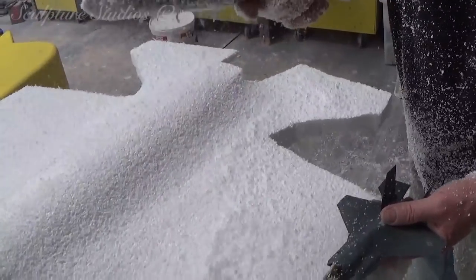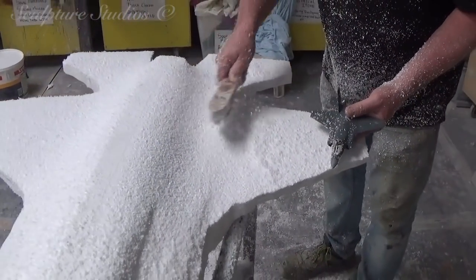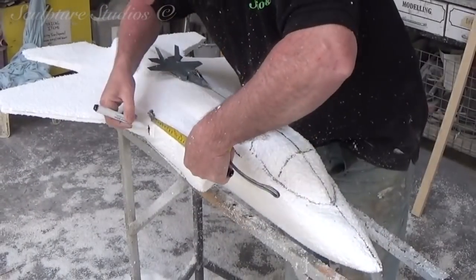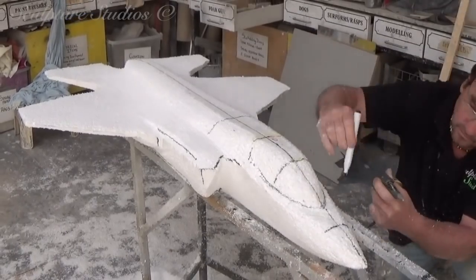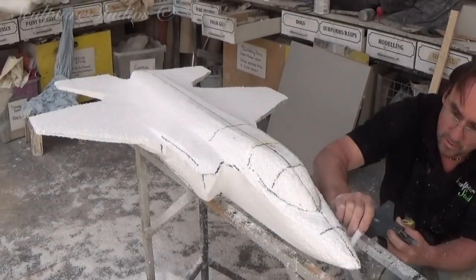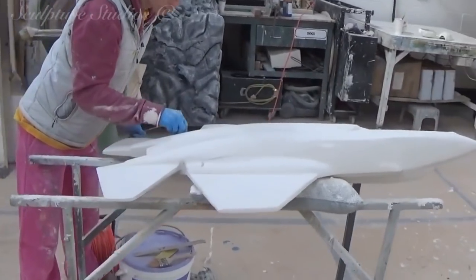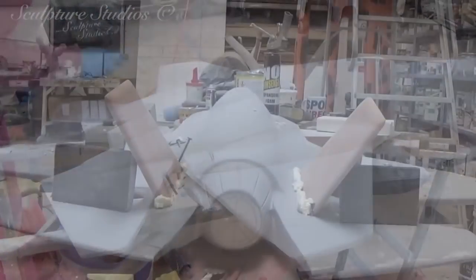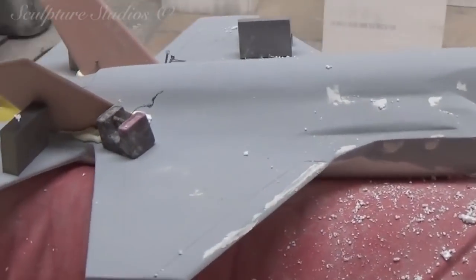As well as drawings, we do have a small replica model here in the studio, as it always helps having a physical 3D object in your hand to refer to. Aidan starts working with a wire brush, a very basic tool for carving, to start shaping the master pattern. The main thing of course is that, as well as generally looking like the design of the F-35, both sides are as symmetrical as possible. The simplified version of the plane is intentional; a lopsided plane is not. With the shape now complete, a light water-based plaster render is applied onto the polystyrene and sanded back to a smooth finish, losing the polystyrene bead texture, as the silicone mould will literally pick out any detail left on the model. This process is repeated until we're happy with the overall surface.